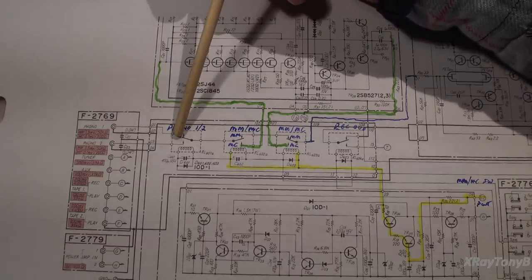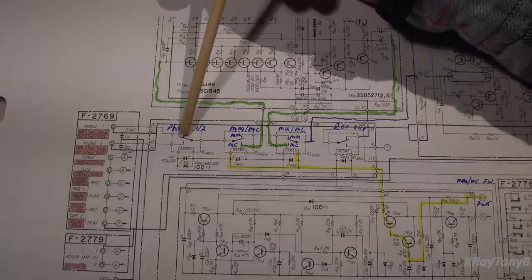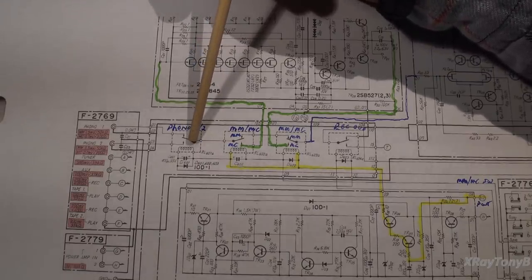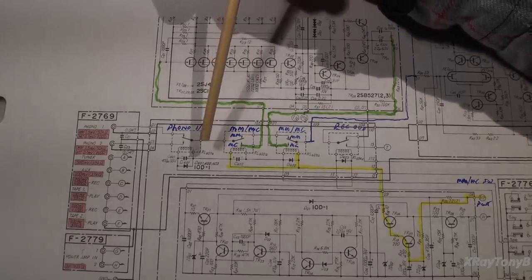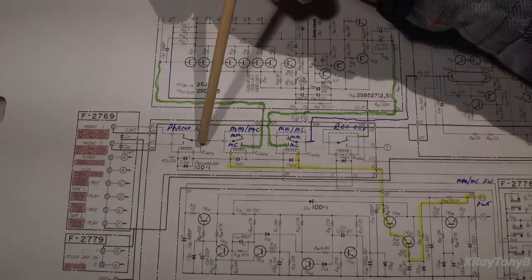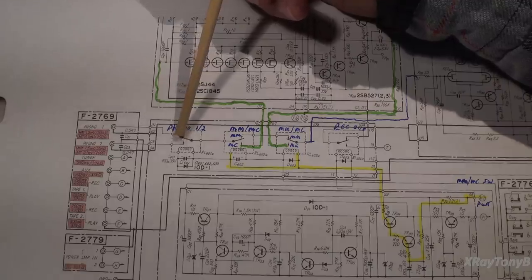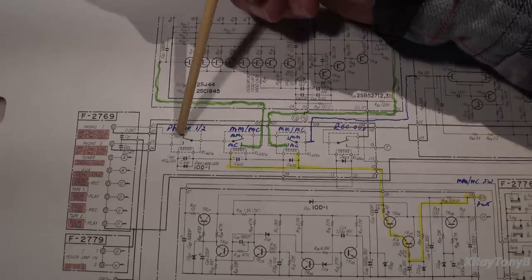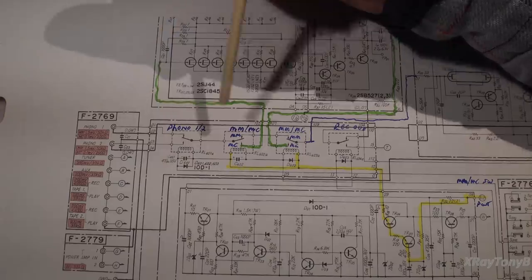And remember, rather than using a 4066 analog switch, like an electronic switch, this is a mechanical switch, which is very low impedance, and when it's switched together, very low noise, and since it's a mechanical connection, it introduces virtually no distortion. That's why they went with this. So anyway, when it's in its normally closed position, you're on the phono 1 jack, and when you energize this one, it pulls in phono 2. So that's how you select your phonographs.